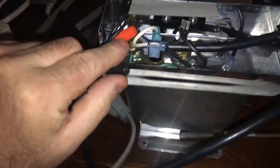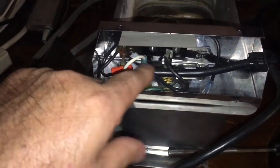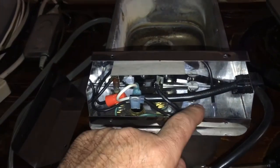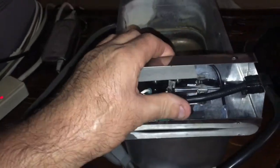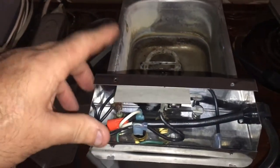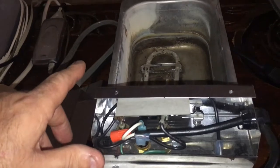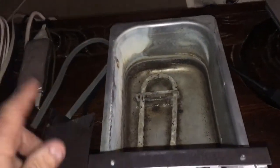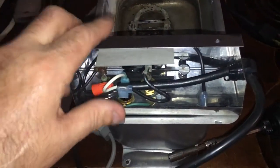What I'm gonna do right now is I just disconnected the float and I'm just gonna hot-wire it, so it just runs on the thermodisc. We'll see how that works for a while. The float's totally shot — gotta get another one. Or I think I'm gonna get a bigger pan, because I don't think this is even big enough. With summer heat, the restaurant's hot, high humidity outside — the new pan can't even keep up, it's overflowing. So I'm gonna get a bigger pan or put two pans in there.